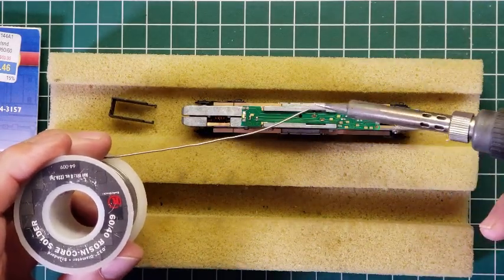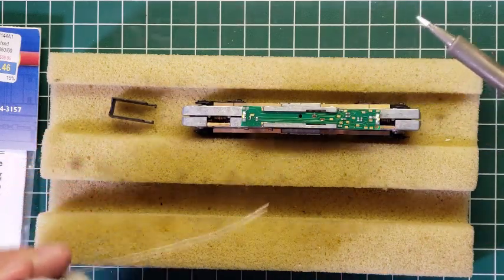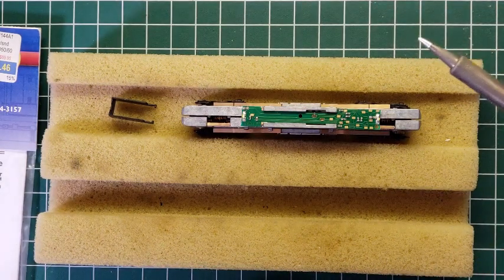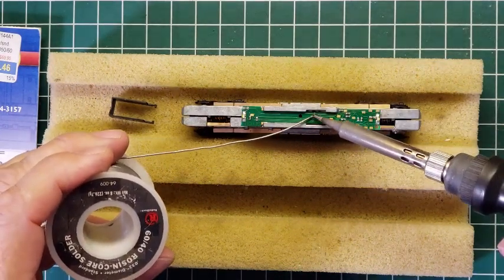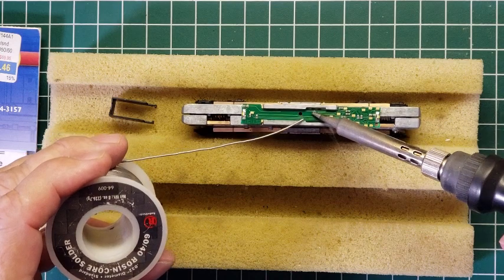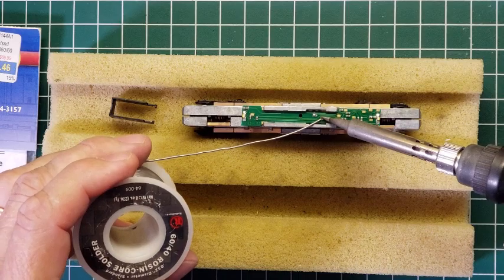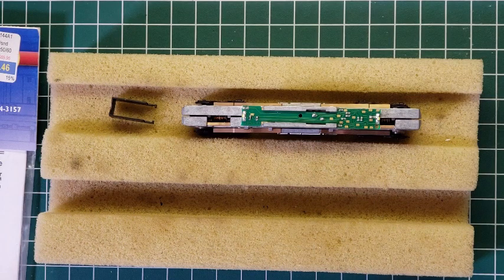So make sure that there is rosin. I've got a new fan, right? So I'm gonna turn it on so you can see there's a lot of noise there. So I'm not gonna use the fan. I got a new fan that drags the rosin smoke. The rosin smoke is what is bad for you. 1,000, 2,000, 1,000. Again, I don't want to spend more than a couple seconds on each one of these. 1,000, 2,000. Okay, so now I've tacked those. Hopefully that's a fairly permanent tack for those.